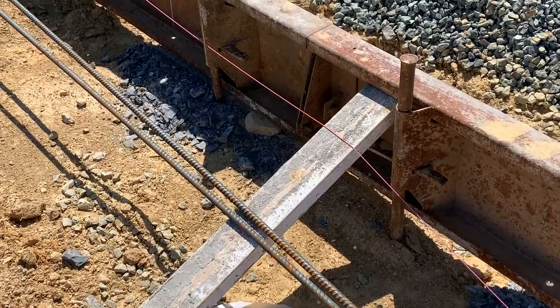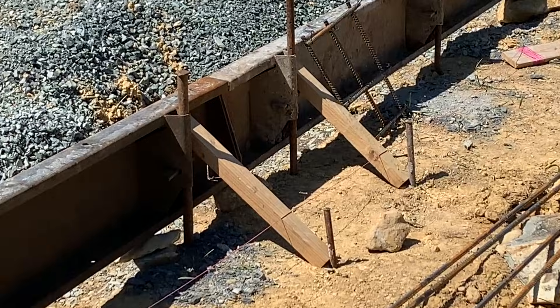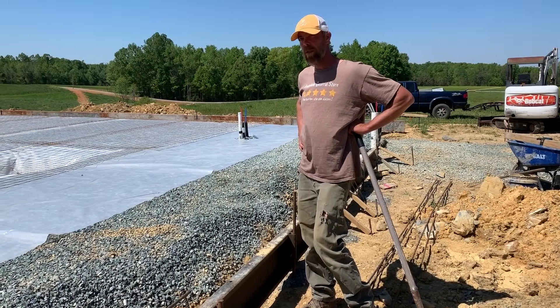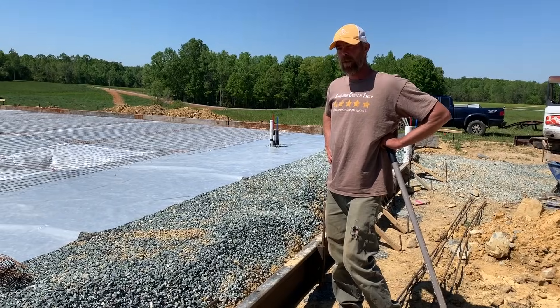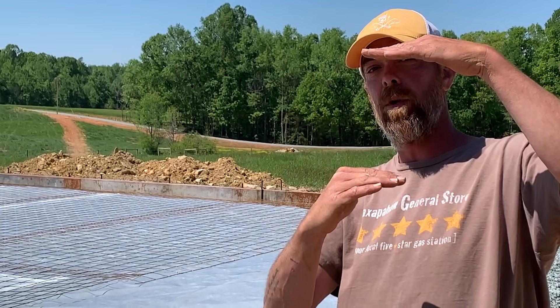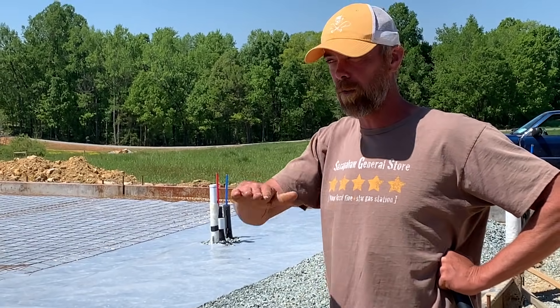So these angled wood braces are really the only thing needed for these metal forms because they're so rigid, to brace for the weight of the pushing concrete. And that lower slump is to set down in the footer first — it's not going to have a whole lot of pressure pushing the forms out. You measure slump from however much they put in a cone and however much it settles from when they pull the cone off — that's how much slump it is. So the wetter it is, the more slump you'll have. A three and a half is what they pour curb and gutter with, so it has to stand up to shaping — that would be perfect for the bottom of this footing. They have to have it a little wetter than that to be able to work and put a flat slab down there. That'll probably be about a four and a half. If we were pouring it without the laser screed, it'd probably be a five or so.